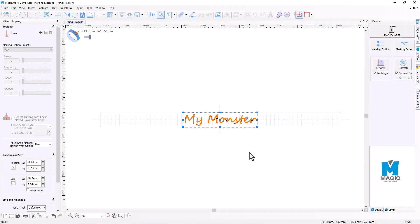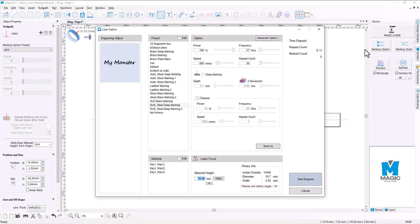Now that we have the rotary fixture engaged, we can select our magic button. The rotary fixture will automatically adjust its angle, and if the height needs to be adjusted on the Z-axis, that will also automatically adjust. Note that the L2 laser doesn't do that — you have to adjust the angle manually. The rotary info at the bottom of this screen will tell you what degree to set your rotary angle to, which depends on things like the width of the ring.